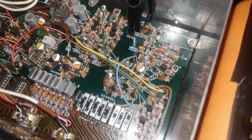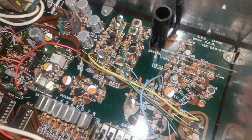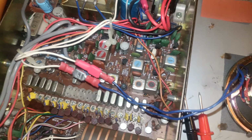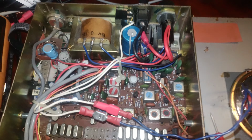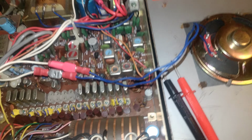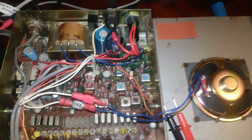Keeping two very old but absolutely lovely pieces of equipment going for as long as possible. I mean, this one probably needs all the switches replacing, and maybe I could benefit from recapping it, because I think the capacitors will be getting on a bit, so I don't think they've ever been changed in that, and the same would apply to this. So that might be something else I might do as well. But they are working, so there's nothing I'm too worried about, but recapping them would be a good idea, and I'm umming and ahhing about removing the entire mains section of this one anyway, because you can see there's a mains transformer at the back, but I never use that because I don't trust the safety of the mains side of that, because the mains side of that, as per the manual, is quoted as 120 volts, although this one is alleged to be fine on 240, but the connector isn't rated for that, and it's a bit tired anyway. And I couldn't be confident whether that transformer's broken down or not, because I have absolutely no idea.